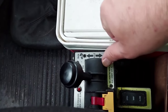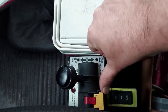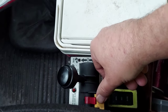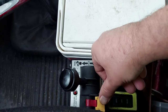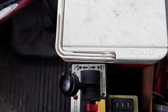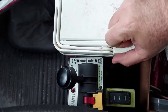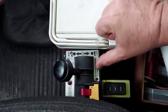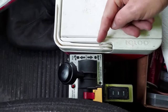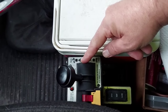Now, let's say you don't know if the PTO is turning on or not. One thing you can do — and I'm not going to do it — is you turn this on, flip your switch on, without pushing the clutch in. If you hear a grinding noise, then your PTO is trying to engage, so therefore you have a pump problem. If you turn your PTO on by pushing your clutch in and you hear air leaking from under the truck, then the airline going to the PTO has been cut or something like that. Your PTO won't engage if it doesn't have the airline attached to it. So listen for an air leak if your PTO is not coming on.